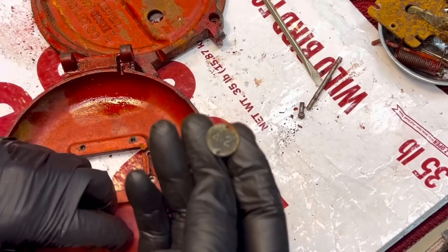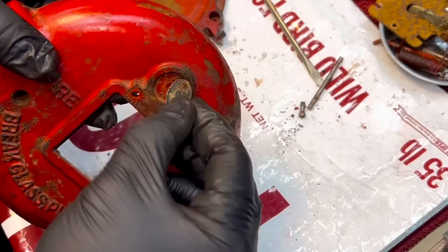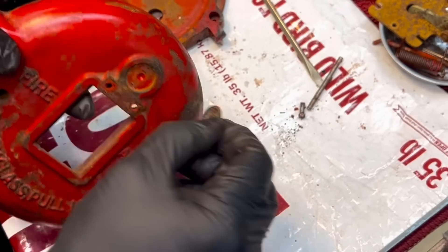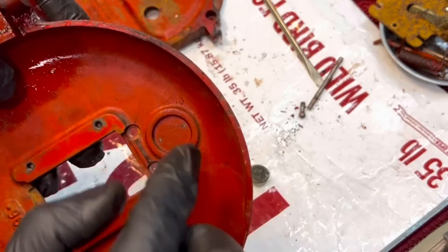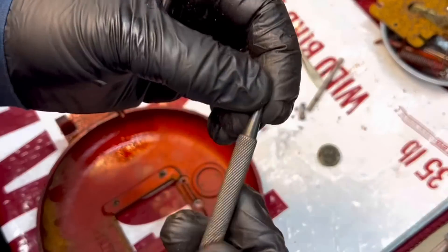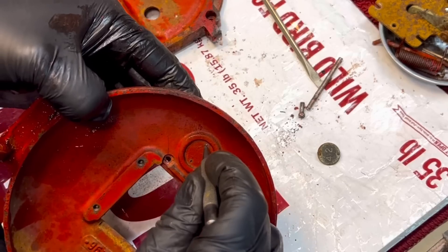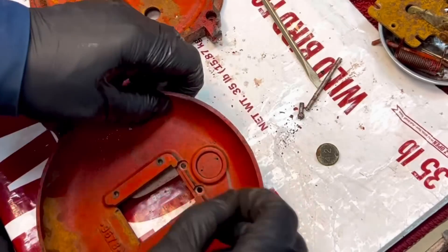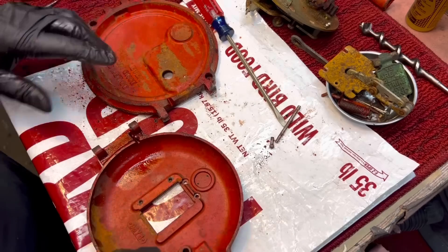Another little dilemma was this tag, number 42, which corresponds to the box. This tag was peened on with two little copper nails. There are just two little holes — they have different tags for different box numbers. I had no punch that small, but I always save my broken punches. I reground a broken one to a temporarily sharp tip to get in there and move it a little, then ground down a nail to punch it out even more. That's how I was able to get that out without destroying it. Sometimes you have to make a tool, but that's all the fun of it.